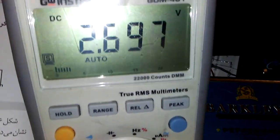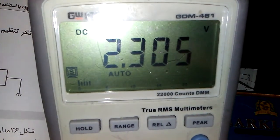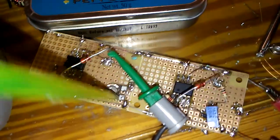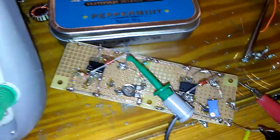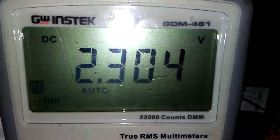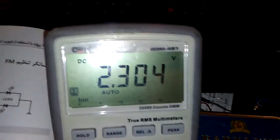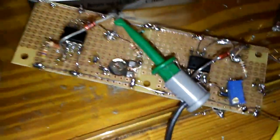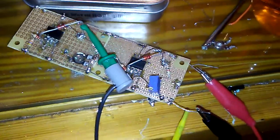I will check the voltage — you can see it is 2.697 volts. I'm going down — it is starting from 2.3 volts. If you change the input voltage from 4 volts to 18 volts, the output voltage should be fixed — we have constant voltage when changing the input. You can see I have 9.327 volts as input and the reference voltage is still fixed. Thanks for watching! The project name is UA 741 positive and negative adjustable voltage reference. Thank you and goodbye.